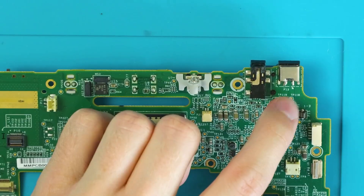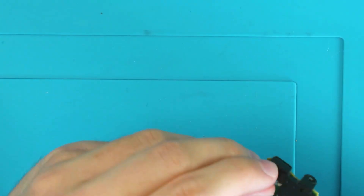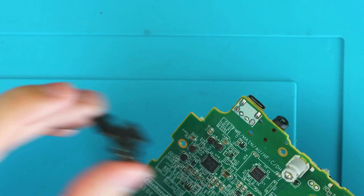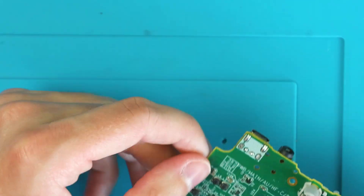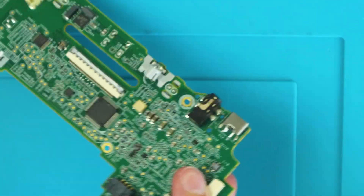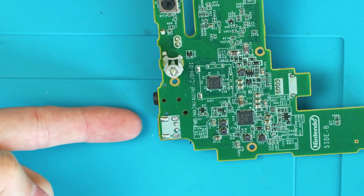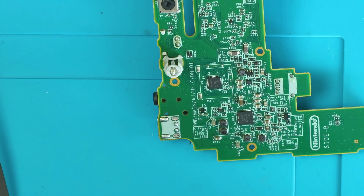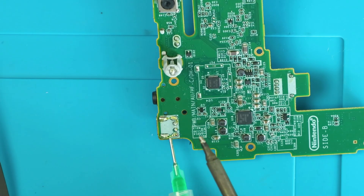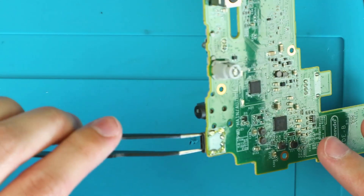After removing the board, yours will look different unless you did the same thing I did, but the process is the same. We need to pop off a little piece of plastic — you'll have four connections with six on the back that need to be reflowed so you can get the connector out. I like to get a little height underneath the connector, set my iron to about 330 Celsius since this is probably unleaded solder and we're desoldering, and then load it up with flux.